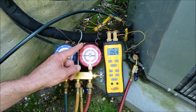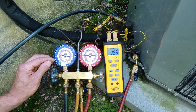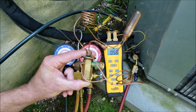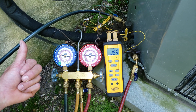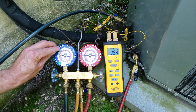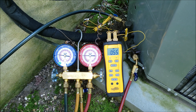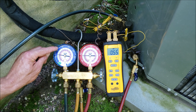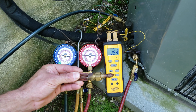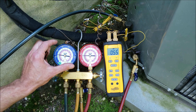The issue is the TXV is controlling the superheat. So if we're trying to raise the pressure here by adding refrigerant, it's not going to help. All that's going to happen is our high side pressure is going to increase because our refrigerant is basically going to get stored in the outdoor condenser coil. This TXV is not going to allow this pressure to rise. So you can't just target a certain pressure on the low side gauge because this TXV is controlling how much refrigerant enters into that indoor evaporator coil.